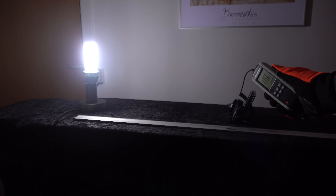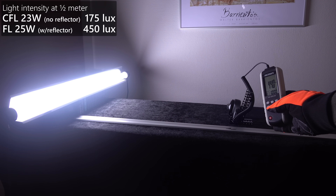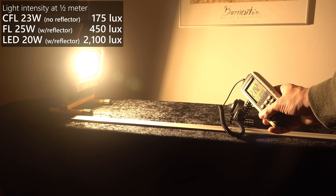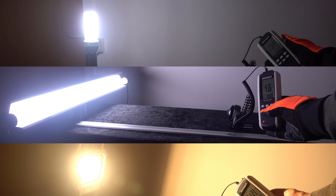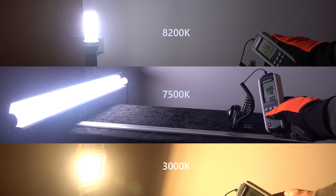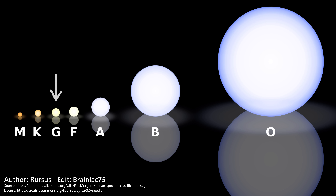For the CFL, I am measuring around 175 lux at a distance of half a meter. For the bigger tube, it's somewhere around 450 lux when fully warmed up. For comparison, the intensity of a 20 watt LED is a couple of thousand lux, and sunlight in a desert around the equator is more like 100,000 lux. Their color temperatures are listed as 7500 and 8200 Kelvin — not really like desert sunlight here on Earth. Our sun is a G-type star emitting white light around 5700 Kelvin; around 8000 Kelvin would only come from an A-type star, 40% hotter and therefore bluer than the sun.